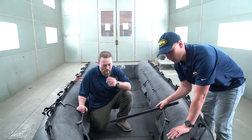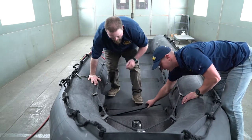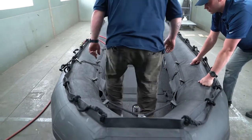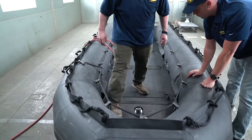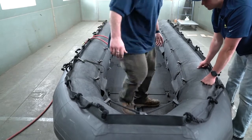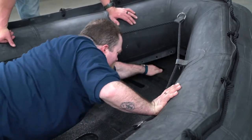Once you get that third bow panel in, all the bow panels are assembled. Ensure you haven't lost any space. The last joiner goes in — note that the joiner is wider on top than on the bottom, so it's easier to install last. Put it on centered and make sure it's even. Then you can hop around the deck boards and use your weight — a jump in the right direction will seat it. You can even pull it back with the hand holes to make sure everything's back where it needs to be. If it's snug, you're good to go.